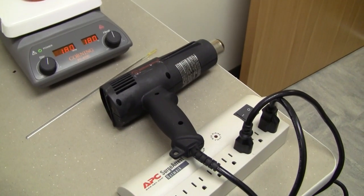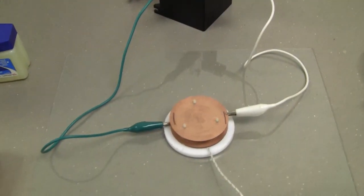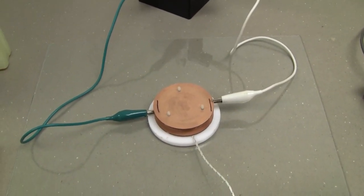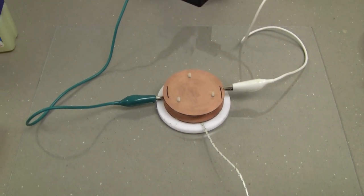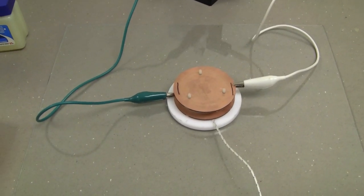The material is poured in hot. I preheat the mould a little bit with a hot air gun just to make sure it doesn't freeze instantly to the sides, and allow it to cool down back to room temperature before demoulding it. Once it's demoulded, I immediately wrap the electret in aluminium foil to protect it so it doesn't depolarise, and I'll let it set for probably a few hours before I play with it.